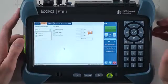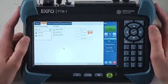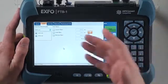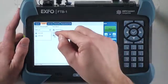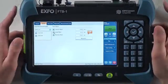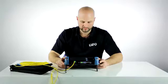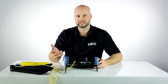So, let's see how this iLoop works. From the main IOLM page, when the loopback mode is enabled on your unit, you will see a new field called loop fiber. From this page, I can set my launch and receive fiber length, and I can check the loop fiber box where I can set the loopback jumper length, and this will automatically enable the loopback measurement within the IOLM. There's no need to go into specific setups or choose a predefined test configuration.